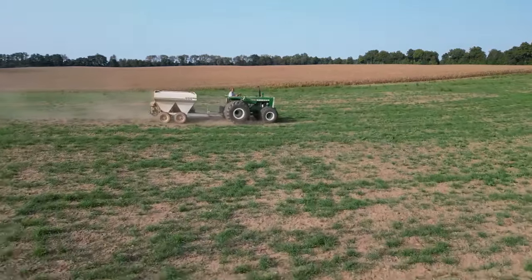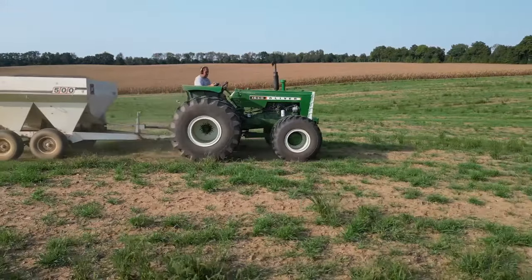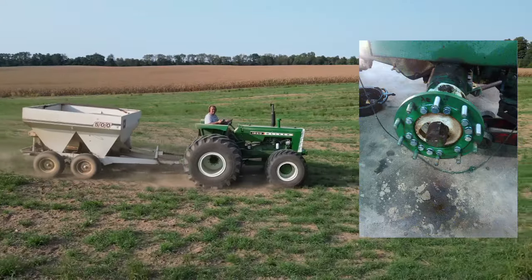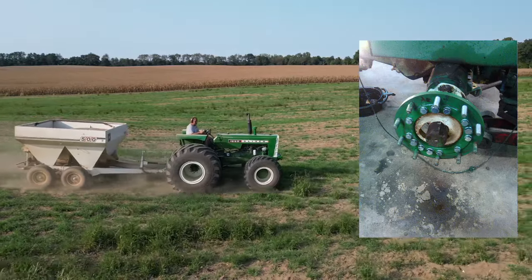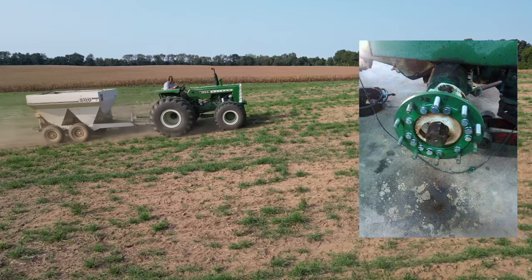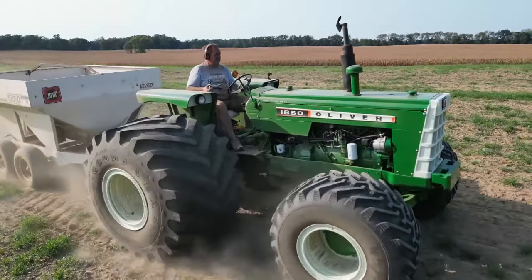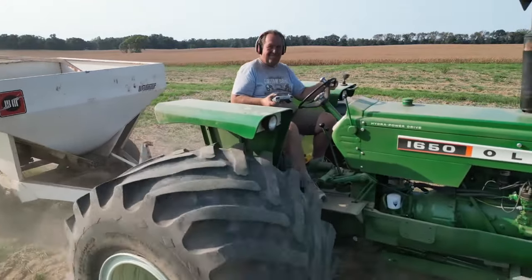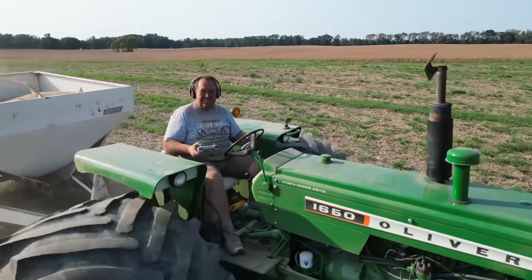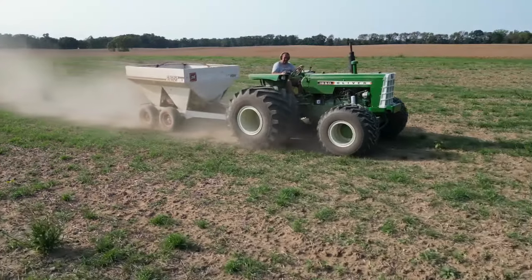And then one other thing that told me they were the original rims is when Oliver will use these adapters to go from the 9-bolt hub, which is actually now a 9+4, that's 13. They added the larger bolts on there. Those larger bolt heads are so close to the next bolt circle on the rim that if the flat wasn't facing the lip of the rim, you couldn't get them on if the point was facing out. Now, like when I did Herman, I knew of this already, and so when I put the wheels back on them, I was putting new bolts in, and I made sure that the flat side was to the outside and not the point, and they went on just fine.